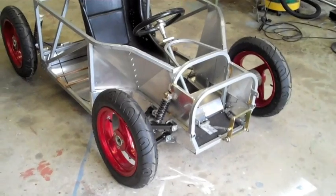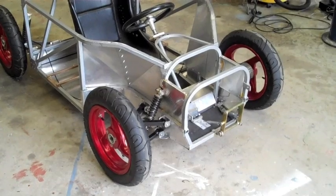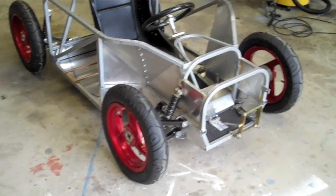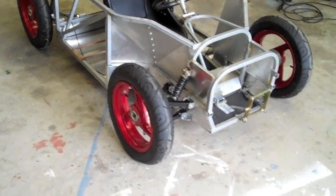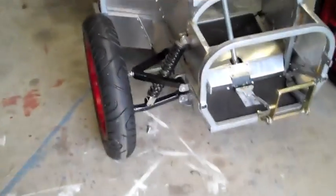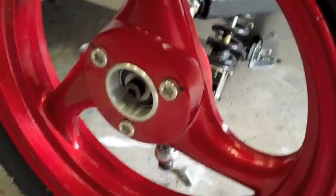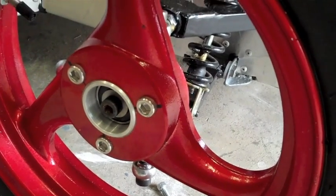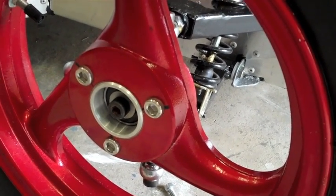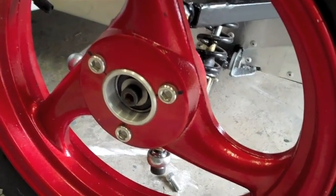The design philosophy of the gravity racer is very simple — it's to minimise rolling resistance, so everything has been designed with that in mind. The weight is under 60kg for the whole vehicle. We've used very skinny tyres at high pressure using scooter wheels, and we've designed our own oil bath hubs. They currently have standard bearings but they'll be replaced by open bearings in a light oil bath, which have much lower rolling resistance than a sealed bearing.